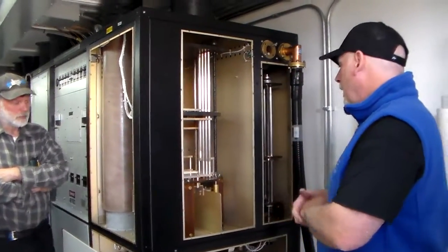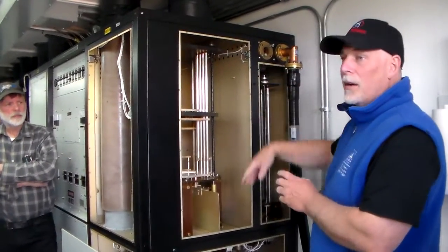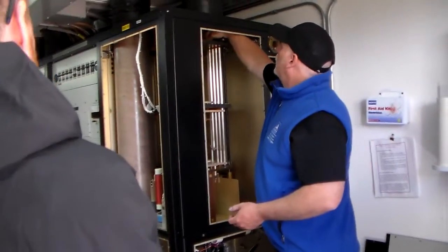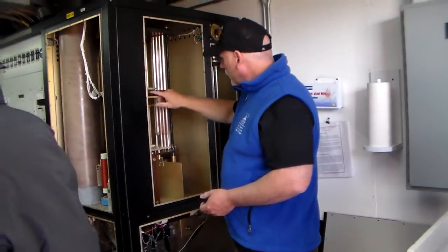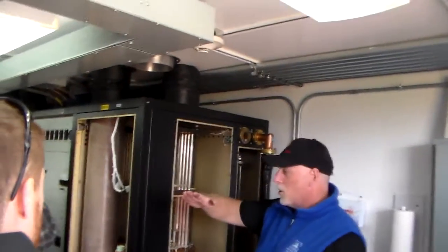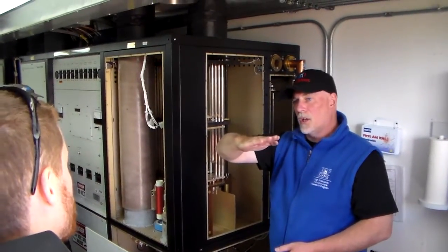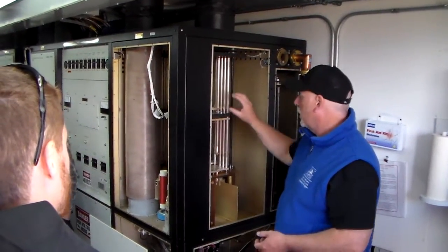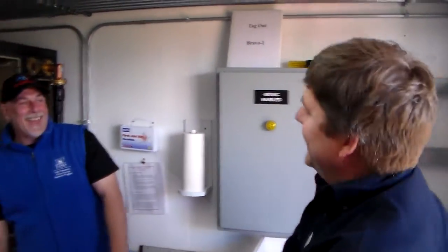The tuned tank is also a transformer, which takes the push-pull configuration from the tubes into the two primaries, sends it into the secondary, and then out the output - with another output coil back here as well, and another tuning capacitor. They are electromechanical devices, so they do require calibration, alignment, lubrication, and verification that everything is correct. If this cog belt slipped, it would offset, and this wouldn't be level anymore. Now you're trying to move this up while it's shifted, so it's going to jam. If it jams, you end up with the wrong tune, and then high voltages in here which are ultimately going to melt all of this stuff. So on any one tune, a lot of parts really move out here.